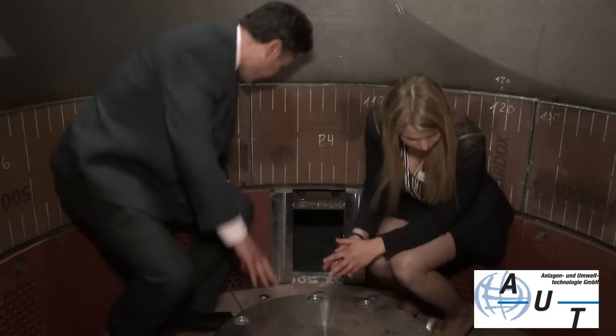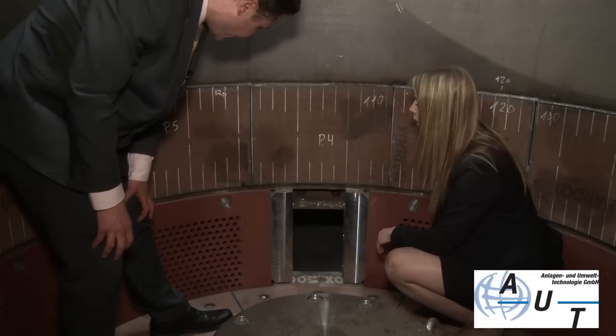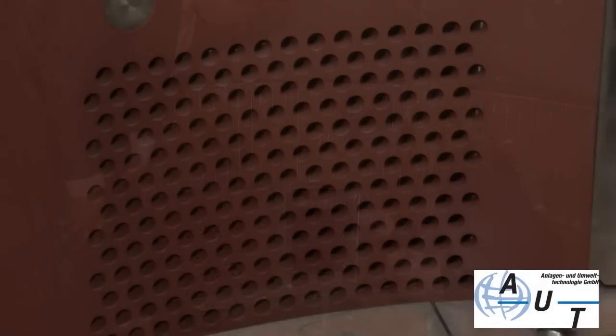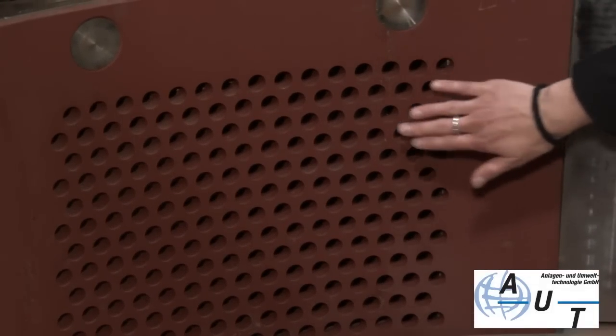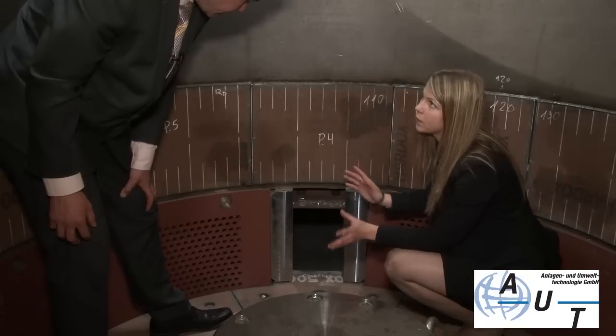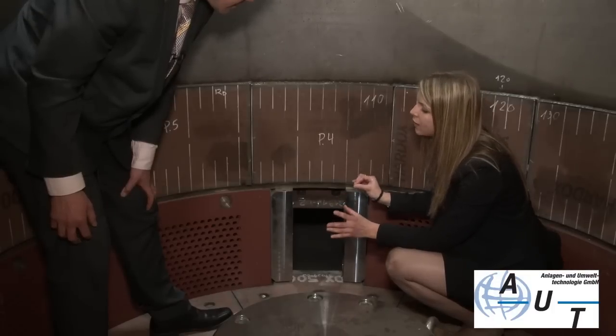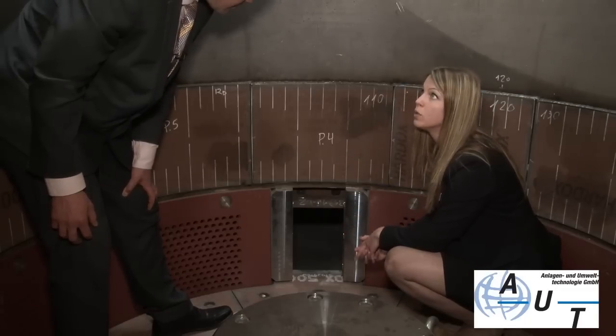And we can see behind us the mesh where the particles exit the chamber. How long would these typically last? The mesh we see in this machine is typically used for RDF because the holes are rather small and customers tend to need very fine RDF. In a three-shift operation, they will last about three months.